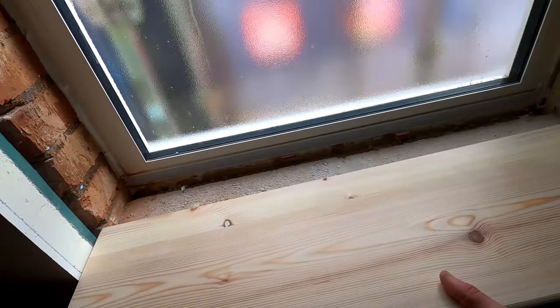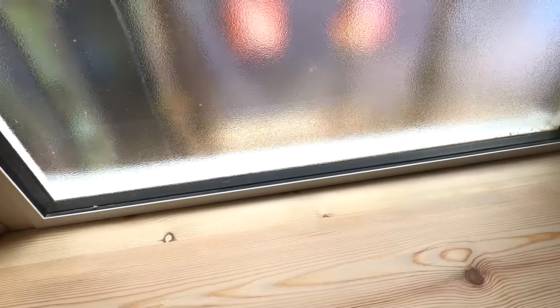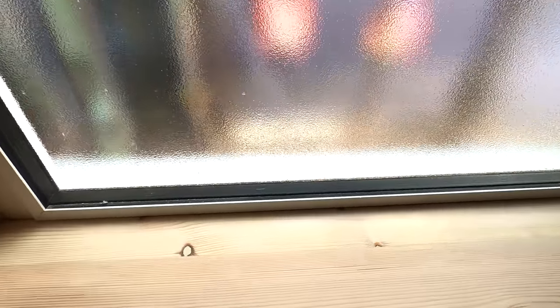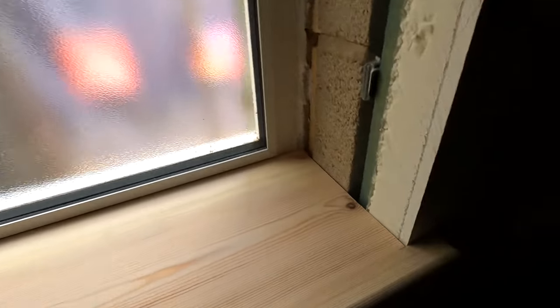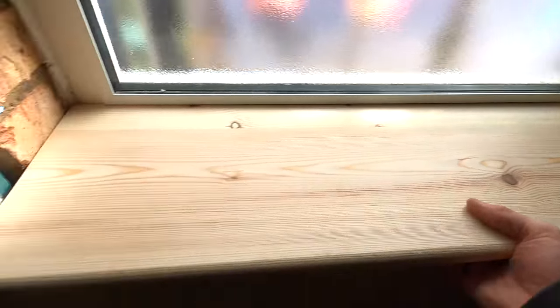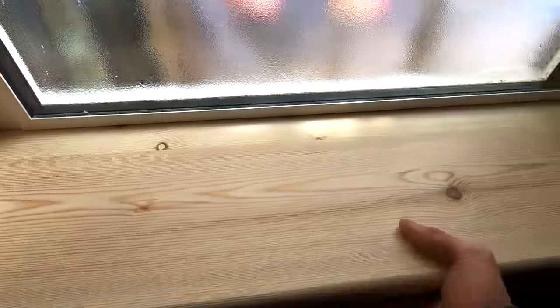Moment of truth — this is always the fun bit. Alright, that's looking good. You can see I'm not right the way back to the frame because I'm tied back to the plasterboard, so we just need to get this level to where it wants to be. Trim around this plasterboard here and then it will just sit nicely back in so when the plasterer skims it, they can skim straight over and it will just be as if it was meant to be there. So yeah, that's good — just a bit of fiddling around these horns and it will be in, then we can show you how we get it fixed down.